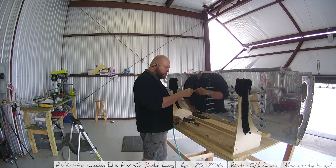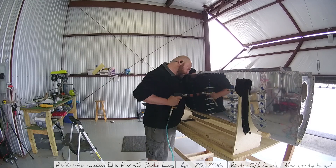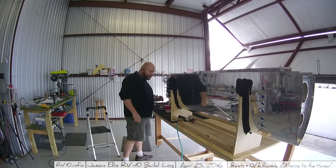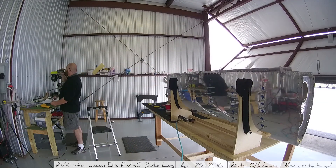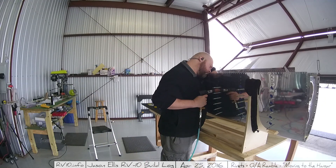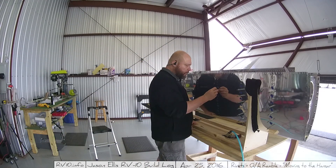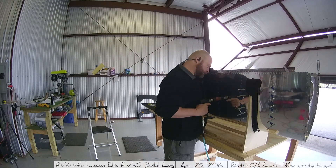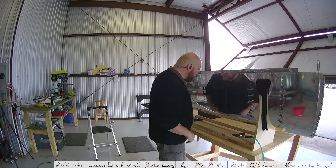I'm doing the bottom here, and then in the next video I'll flip it around and do the top. The bottom is kind of flat until you get towards the very nose, and the other side is not flat at all — so that gets a little awkward. When you're standing up on a stool and reaching deep down in there using the gun to seat the rivets, just don't rush. Make sure you have the bucking bar square against the rib inside, because if you have it canted left or right, up or down, you'll leave a dent — and we want to try to avoid those.